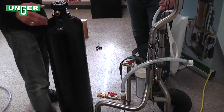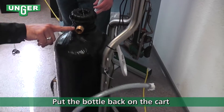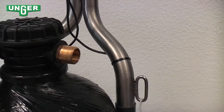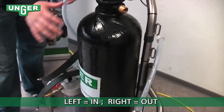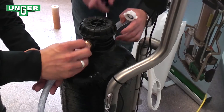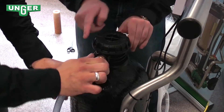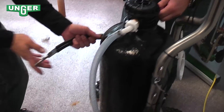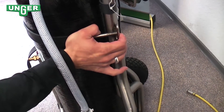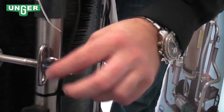Hand-tight is enough. Now put the lid on top of the tank. On top of the cap, you can see two arrows that let you know which direction — the arrow on one side is your input, and the arrow on the other side is your output. Make sure your hoses are screwed back on, and the last step is to put the straps across the tank and tighten them with your butterfly nut.